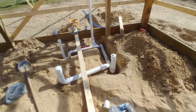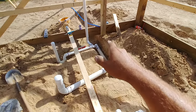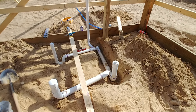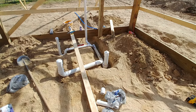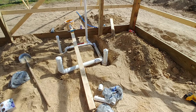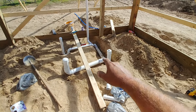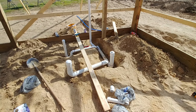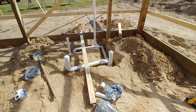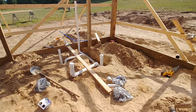The last thing to mention is your main sewer line: as it comes out from underneath your foundation, it should be 18 inches below grade — at least that's where I'm at. That does depend on where you live and your environment, but the reason it has to go down that far is to prevent freezing of your lines. It needs to be 18 inches from the top of the pipe to the top of the grade. In some areas they require up to 30 inches, but here it's 18.